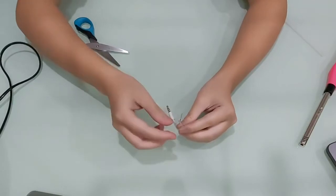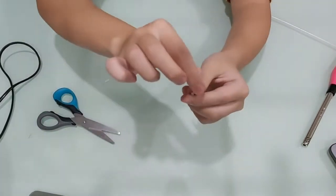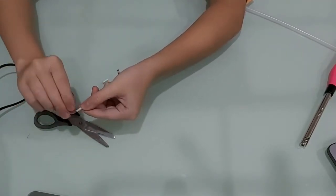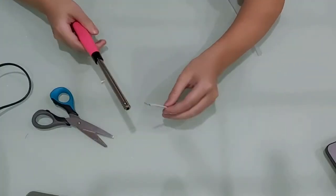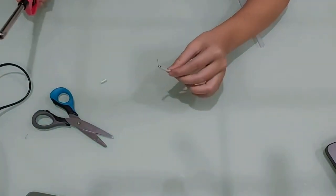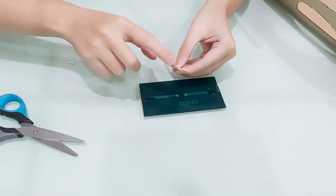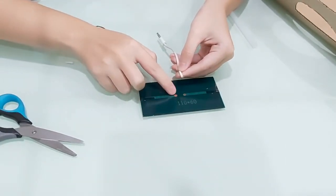In this experiment, we wouldn't need the red wire, so I will be cutting that off. Now, I'll just twist these together. This is the final result — we are left with the ground wire and the speaker wire. Make sure that the ground wire goes to the negative, and the joined blue and green wire goes to the positive.